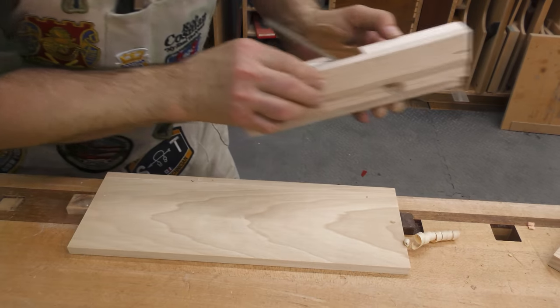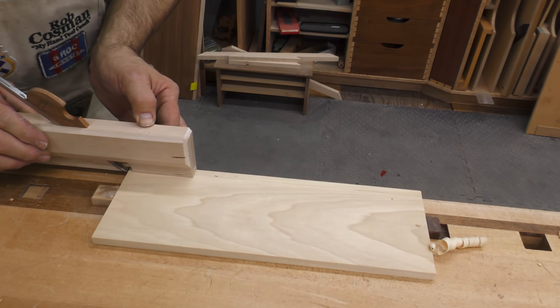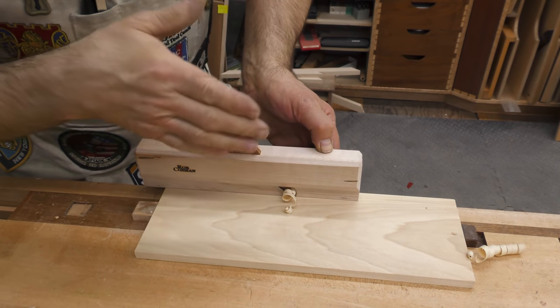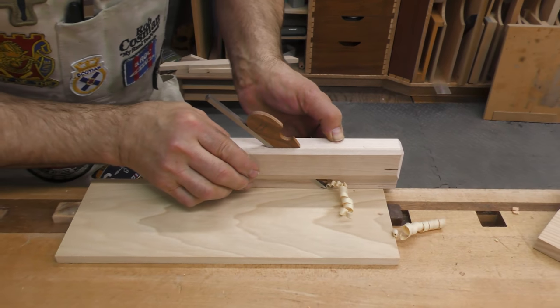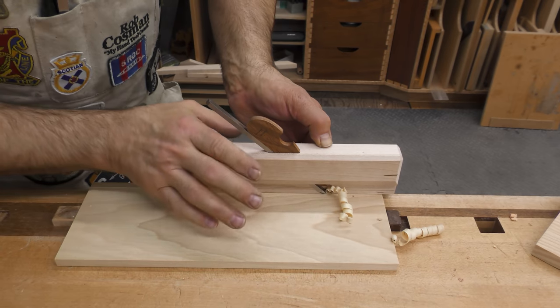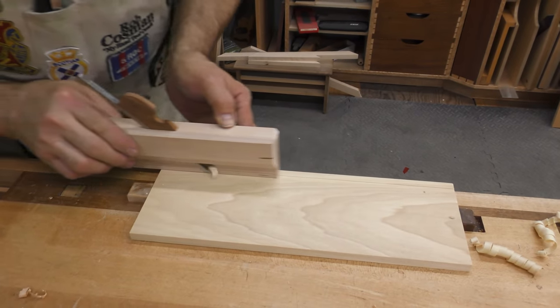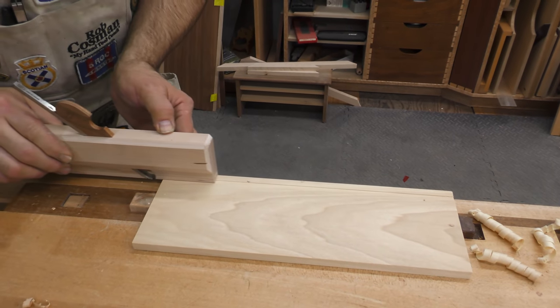go all the way through, and I shift my weight so that up here, all my weight's at the front. Here, I'm pushing down on a 45 with both hands, and as I get toward the end, I back off and the pressure is here to prevent that from nosediving. And I'll take as many cuts. I usually don't bother pulling the plane up.